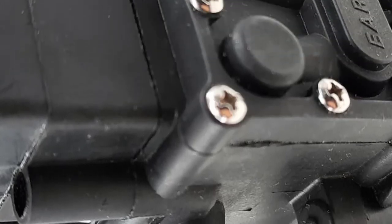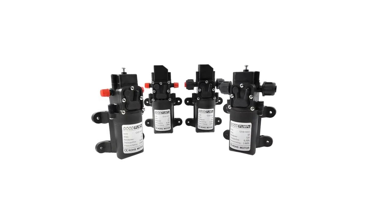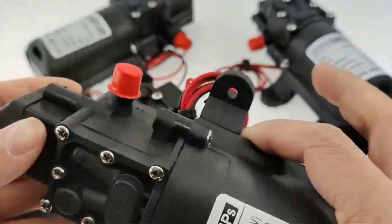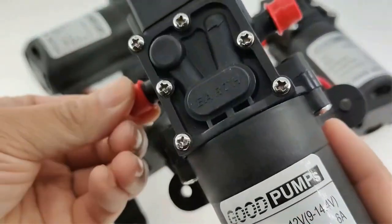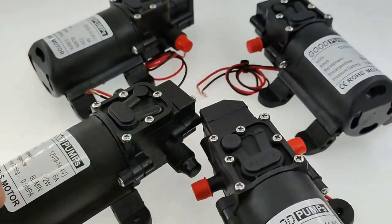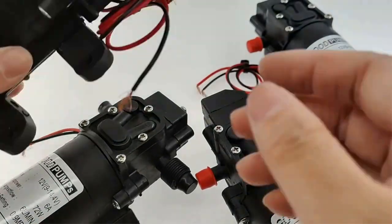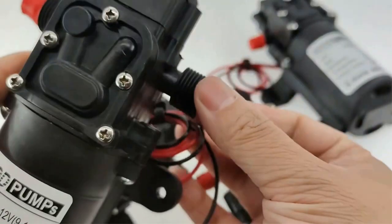Thus, the air in the fixed volume pump chamber is compressed, the exhaust port is closed during compression, and the exhaust port is opened to form a micro positive pressure. When stretched, the exhaust port is closed and the intake port is opened to form a negative pressure, and a pressure difference is generated between the pump chamber and the external atmospheric pressure. Under the pressure difference, the liquid is sucked into the pump chamber and then discharged from the drainage port.